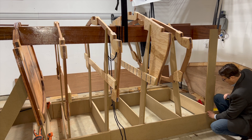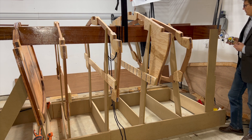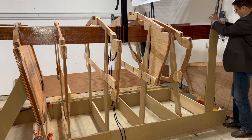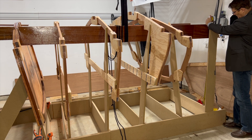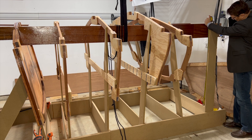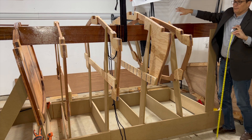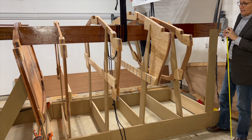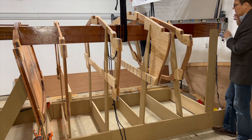Therefore, what I need to get to here is three quarters of an inch plus 42 and a half, which would be 43 and a quarter inches from the bottom. Right now I am at 42, so I'm going to put my tape measure on here and start cranking this up until I get the height to 43 and a quarter. I'll do the same thing on the port side stringer, get that one leveled up, then take a level to make sure they're parallel.